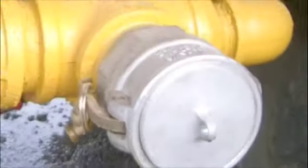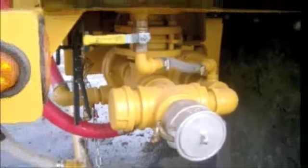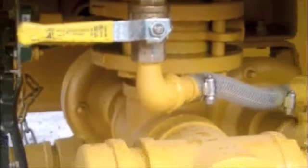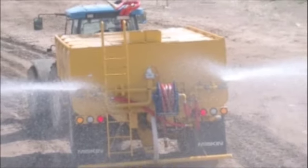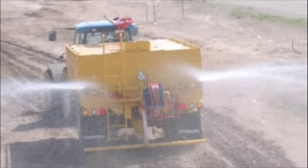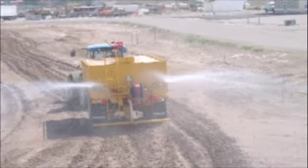Suction fill ability for self-loading is standard on every water wagon. There's a water storage chamber inside the tank for priming the suction line. The water wagons have hydraulic service brakes and spring-applied, hydraulically held off parking brake. And don't forget the hydraulic jack.